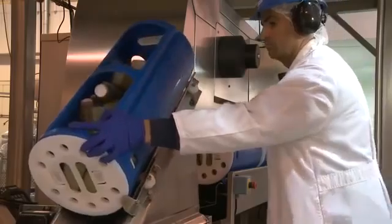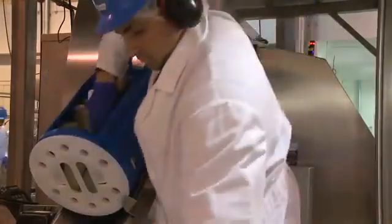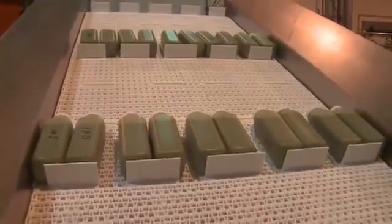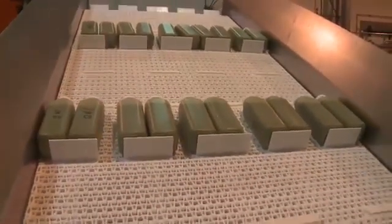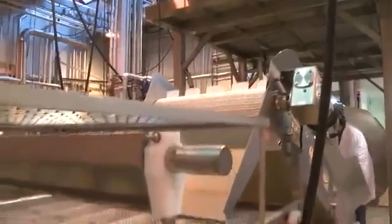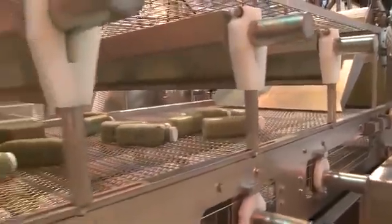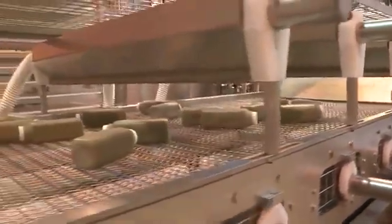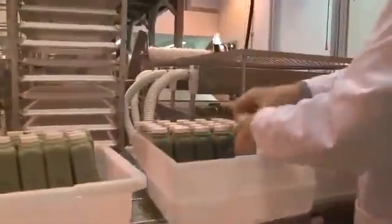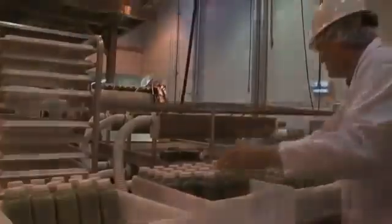The product has been unloaded from the machine and now we put it through its downstream processing. The conveyor works to shake off some of the excess moisture and also gives us an opportunity to separate out the product. From that point, it moves onto a drying rack. On the drying rack, there are three air blades that help to remove the moisture from the packaging. Once it goes through this drying, it is ready for final packaging, whether you're placing labels at this point or just putting it into its master cases.